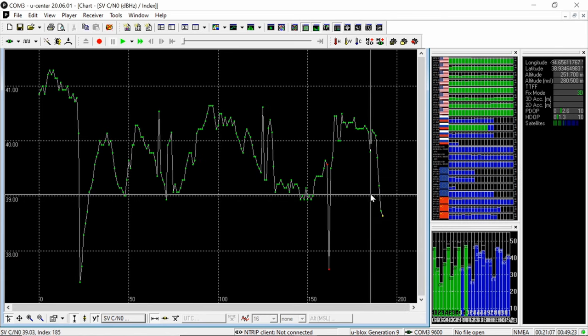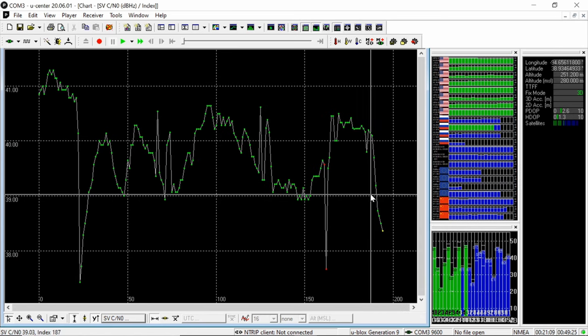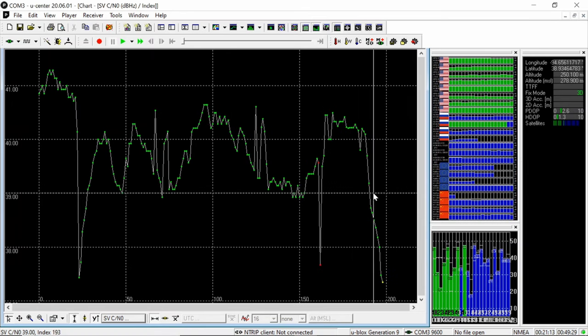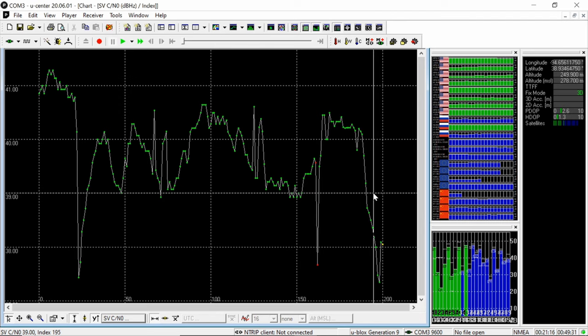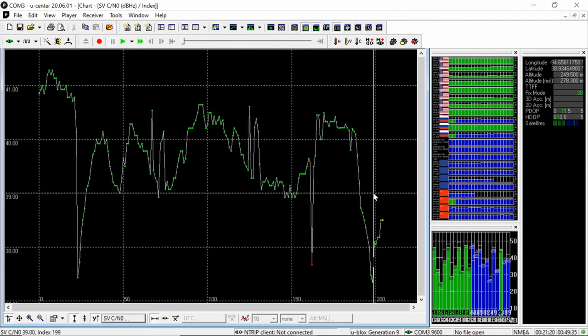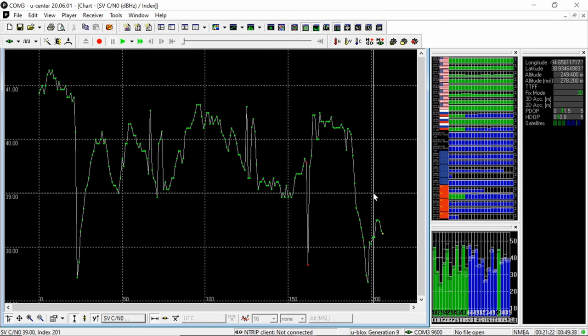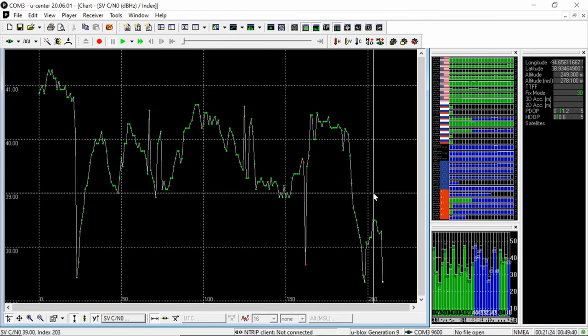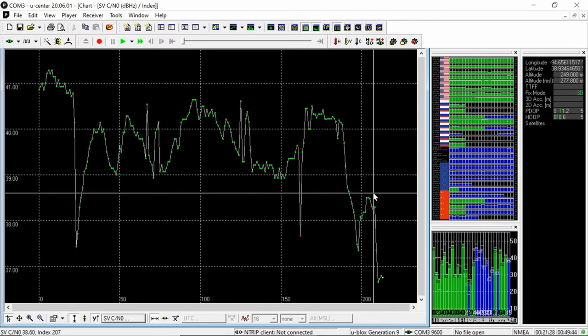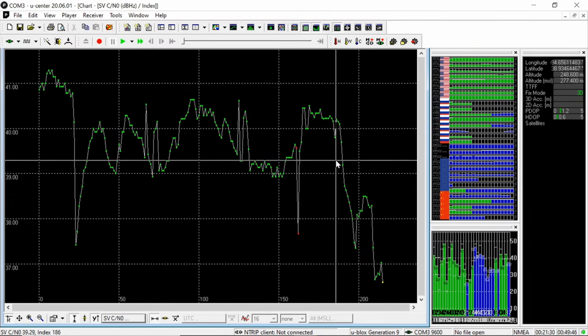The C/N0 is going to go down again. It's the C/N0 of all the satellites that it sees, even the ones it's not tracking. So what I'll typically do is go in and configure it for GPS only, and tell it to only choose 6 satellites. Turn off all the receivers except 6. Then it will pick the strongest satellites, and I'll get a better reading for C/N0, but this thing seems to be working pretty good.